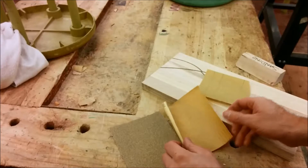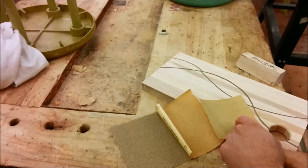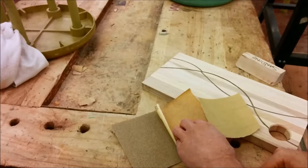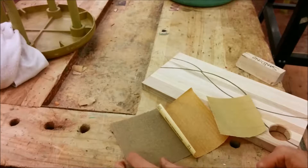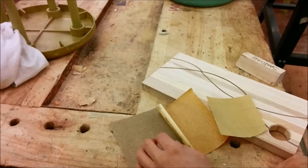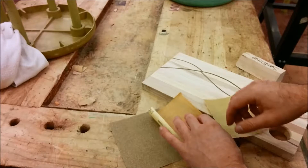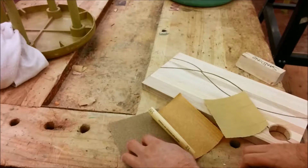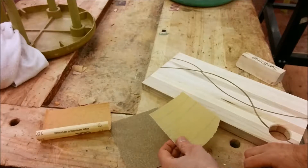So that's 100, that's 150, and that's 220. You can tell that this one's really coarse, this one's sort of medium, and that one's a little more fine. For rough sanding where you're removing a lot of material, you want to use the coarse sandpaper. Then once you're done with that, move up to the 150 to remove the scratch marks that the 100 made. Then the last step is 220 grit.